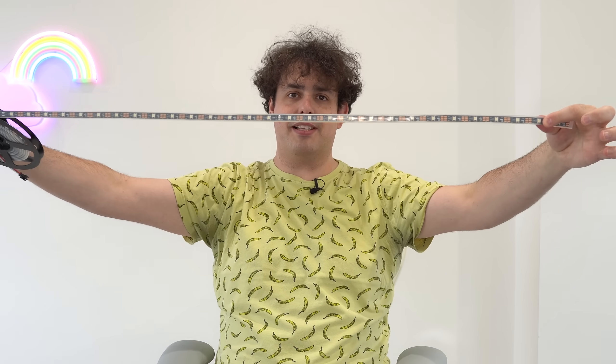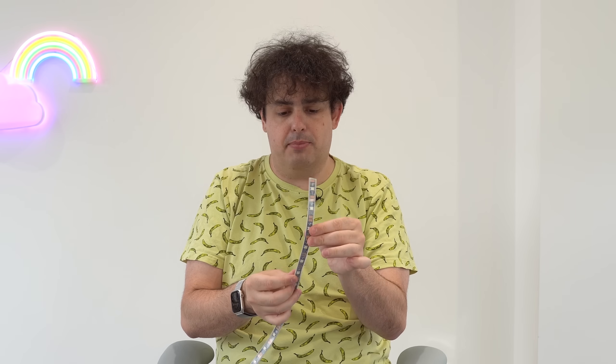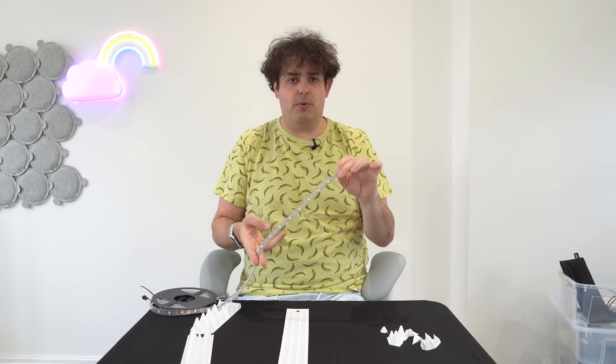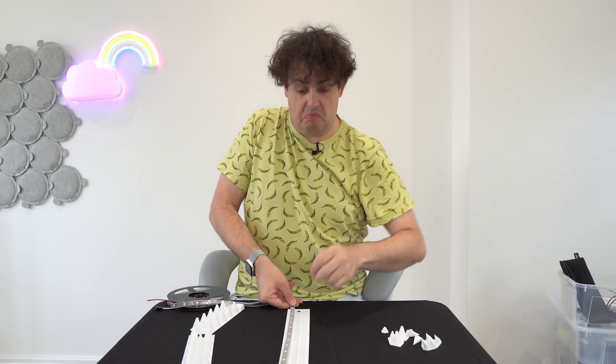For those of you who haven't seen, you can get strips like this with LEDs — little lights. You can get them in a water-resistant version where they're in a silicone case, or without that. The ones I've got here are commonly known as NeoPixels. They do red, blue, and green, and every colour you can mix with all of them, including white if you turn them all on at once. And you can chop them in between each LED to get them at whatever length you want. I decided 10 was about right.